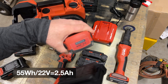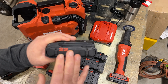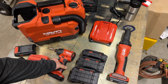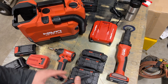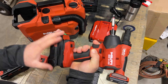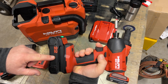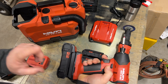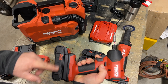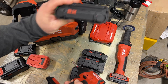Comparing it to what we're used to in their old system, or Milwaukee, DeWalt — every other battery company rates batteries in amp-hours, so let's just give them a one-for-one on this. This is 1.2 pounds, very compact. Compared to all three other batteries, it's smaller and it fits really well on a tool like an impact driver. It's a great battery for working in multi-positions overhead — lightweight, great runtime, but not for the most demanding tools. I don't think you'd put this 55 watt-hour on something like a vacuum for extended use. It'll work, but it won't have the runtime you need for higher-demand tools. Drill driver, impact driver, multi-tool — things like that.